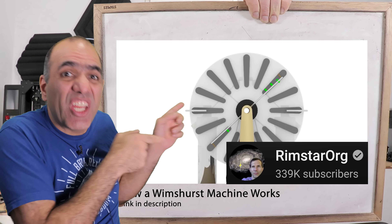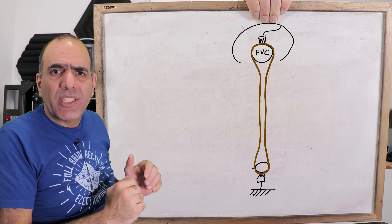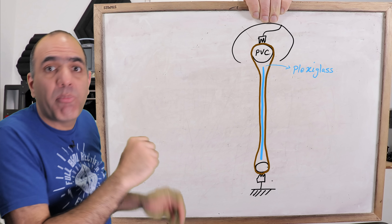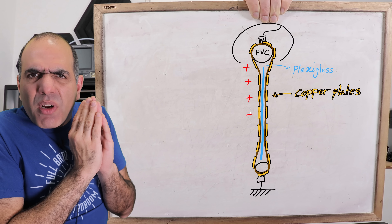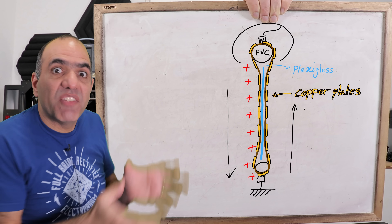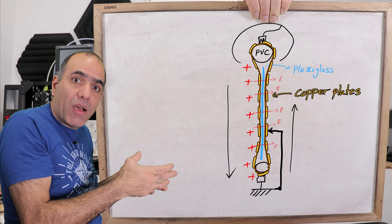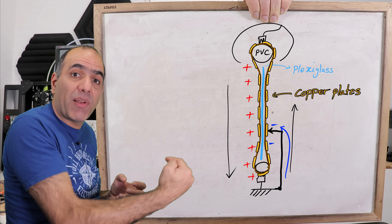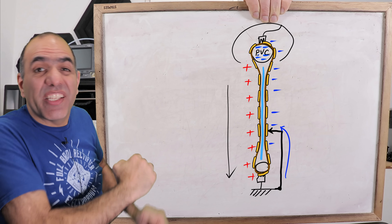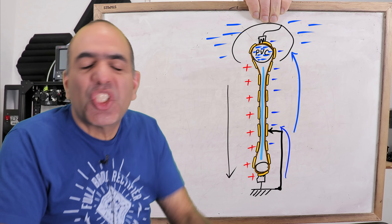The Wimshurst machine has two circular plates rotating in opposite directions and small metal plates on them that push and pull charges with capacitive coupling. Wimshurst.org has a great video explaining how it works. What I wanted to do was push the belt sides close to each other while keeping them isolated by plexiglass. Then, similar to a Wimshurst machine, place copper plates all the way around the belt. My thought: why neutralize the belt at the bottom and send it back up while I can pre-charge it with electrons? I could connect earth to the belt, and electric fields from the positive side of the belt coming down would suck electrons into the opposite plates, charging them negative going up. That way, not only do I create negative charges by triboelectricity via PVC, I pump extra electrons into the top dome — much higher voltage, so much arc.